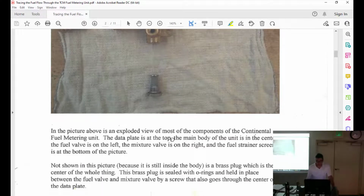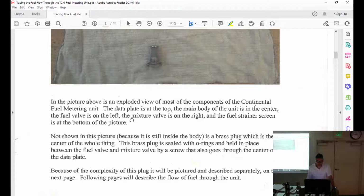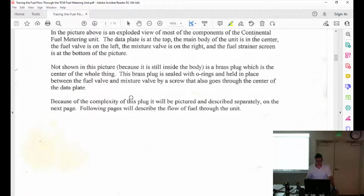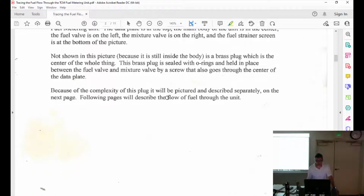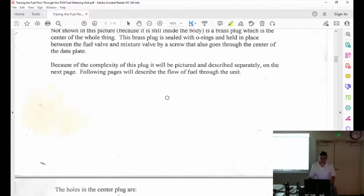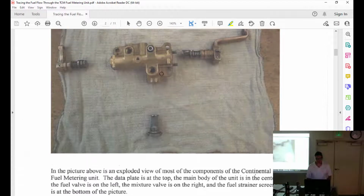All right. Exploded view, fuel valve on the left, mixture valve on the right, fuel strainer screen at the bottom, we saw that. Not pictured because it's still inside the body is the brass plug, which is the center of the whole thing. That is going to be in the next picture. The brass plug is sealed with O-rings held in place between the fuel valve and mixture by a screw. So what it's saying is there's a brass plug, and the screw right there holds it in. Notice right here,